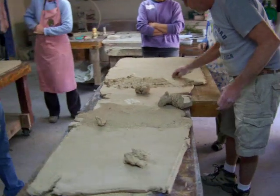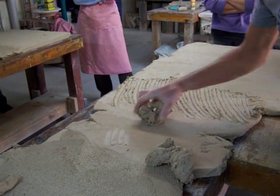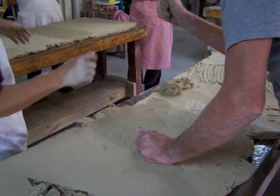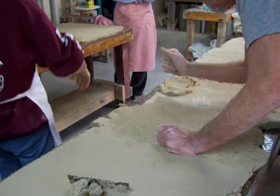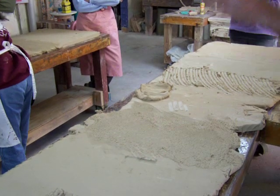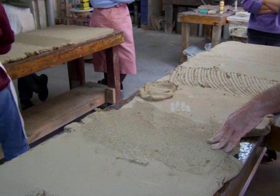This is really pure, high-temperature clay, so I found that it shrinks a little bit less. One time we were in Canada doing a workshop and the clay was a lazy clay — it was thixotropic. We put that slab on the slab roller and it was like silly putty: it feels stiff but as soon as you start to move it, pound on it, or jiggle it, it'll just sag. Xenia noticed that immediately.